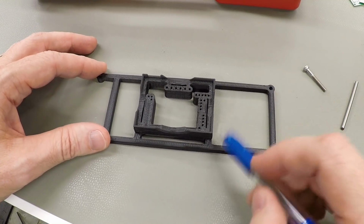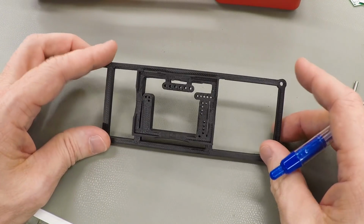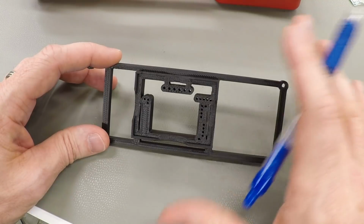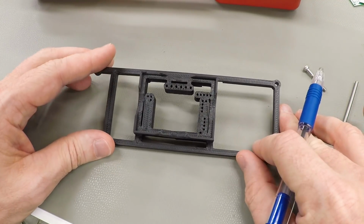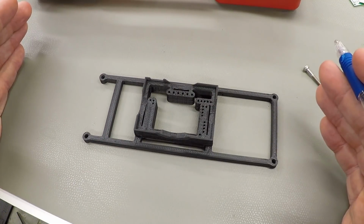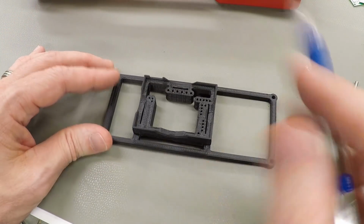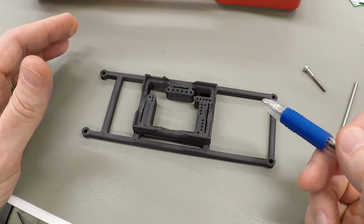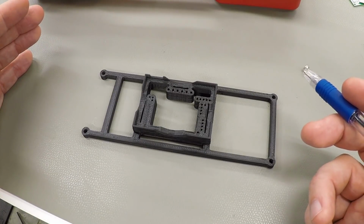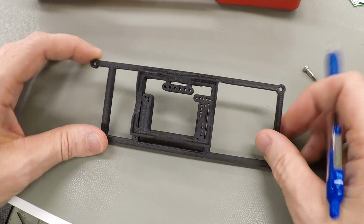The only thing that it really could be is either the calculations in the printer for how many steps to move are wrong. I'm pretty sure those are right because I calculated them. I didn't measure them. I didn't do any kind of adjustment. I just calculated them off the mechanics of the printer. And the printer is moving, again, with 2 millimeter pitch timing belts. So one revolution of the motor, which would be 200 full steps on the stepper motor, is going to move it, with a 20-tooth pulley and a 2 millimeter pitch, 40 millimeters, and that should be as accurate as the pitch of the timing belt.